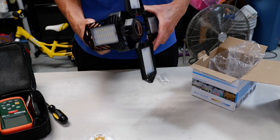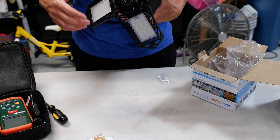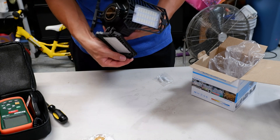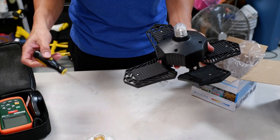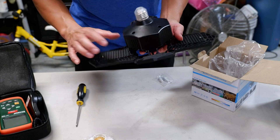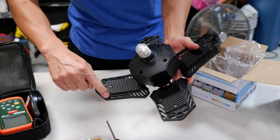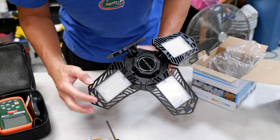The light itself is pretty versatile — it's one of those that has adjustable wings, so you can actually adjust the angle and point in all four directions where you need the light. They've got little set screws and set nuts on each side so you can hold them tight. It feels like plastic but it's actually metal — if you hit it with a screwdriver it bounces like metal. It's lightweight and hollow, and with all these little fins they help heat dissipate off the LEDs.